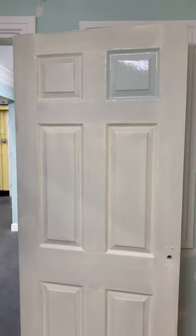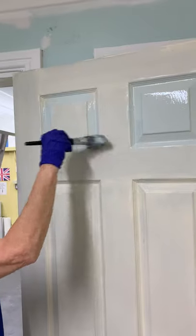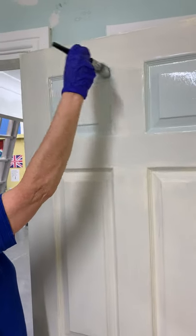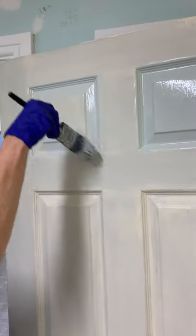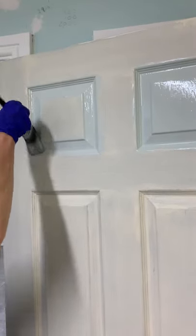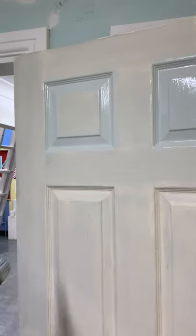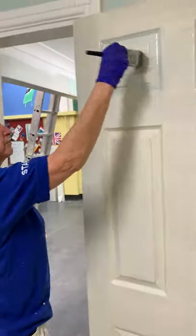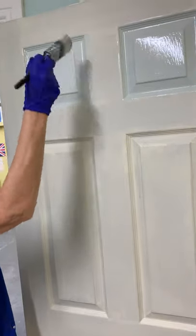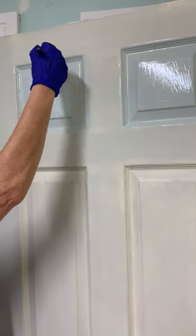Add a little more paint and work away from the corners. When using your brush, don't keep it at one angle — change the angle as you go so you get into the mouldings. I'd rather be dragging this paint about thinly than have it run. When the paint runs out, get a little more for the panel. Crisscross motion, really work it out and spread it out, lay off horizontally, then lay off vertically, then tidy up the mouldings.